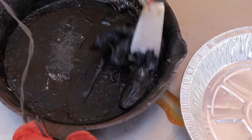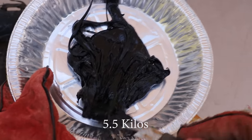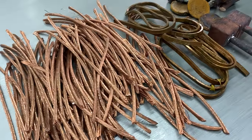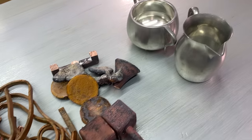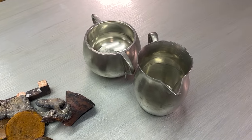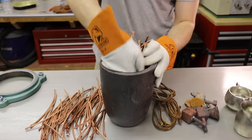As the shells were heating up, I started melting some metal. I needed 12 pounds of bronze to fill both molds, so I made my own using 92% copper and 8% tin. For a source of copper, I mostly use wire, but for tin, I use these pewter cups. They consist of about 95% tin.